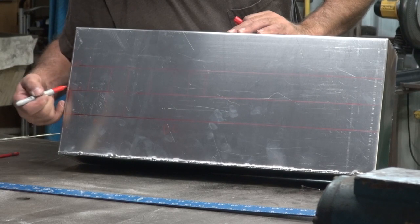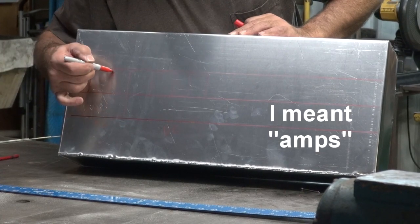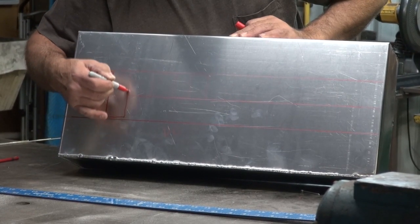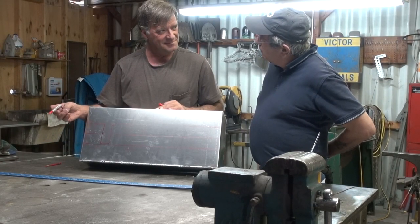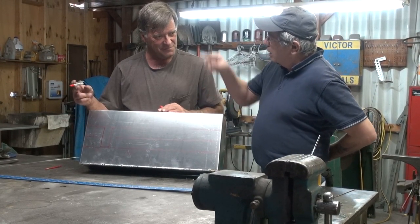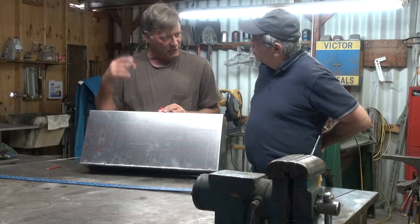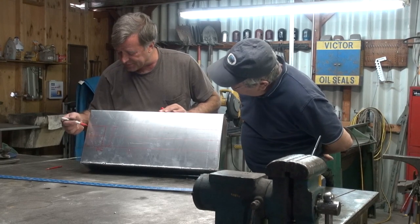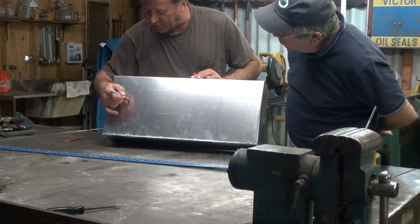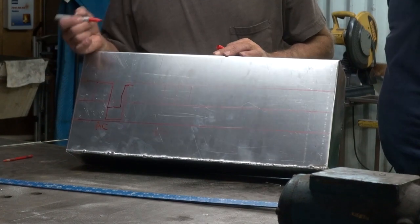What I was saying was: figure zero volts, and when your pulse spikes up to, let's say, a hundred volts, pulse, and then drops back down to a negative, and then back up to positive again. So when it gets down to the bottom, the energy is not going into the tip of the TIG welder. Is that the bottom part of the pulse? Well, this is actually AC. This is what AC current actually looks like if you look at it on an oscilloscope. The pulse — how can I correctly draw that? The pulse would be a pulse up, pulse down. You would get to a lower current somewhere, and then it would pulse back up again. That's kind of what it would look like on AC.